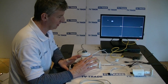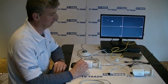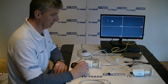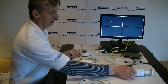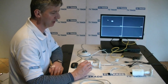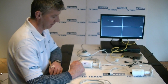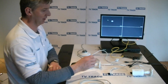We're adding three cameras at one time for two purposes: number one, to show it's possible, but number two, to show the whole issue of IP conflicts and how to actually resolve them. I have little names on each camera — two cameras are called 'default' because they're using their default IP addresses, and this third one I've brought to the PC and changed its IP address so it's different from the other two.